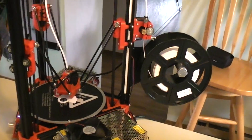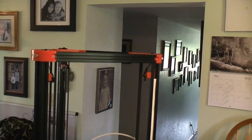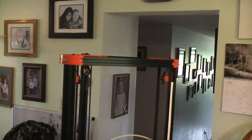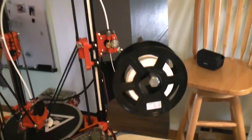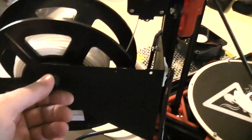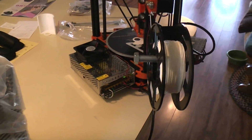When you build it initially, the extruder is shown bolted up on top, but the problem is it's hard to reach and there's no filament holder that can feed into it unless it's hanging from the ceiling. So I moved it to the side rail. I grabbed a chunk of metal that used to be a cover off a computer PSU — just thin metal, but it doesn't need to be much — ran a bolt through it and bolted it to the side. Now the filament and everything is one piece; I can pick the printer up and move it as one unit.